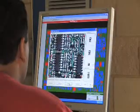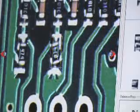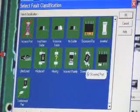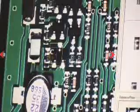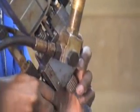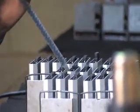The machine scans all parts on the board and then compares it with a known image as to what it should be like. It will detect any wrong parts, skewed parts. We can set the sensitivity of the machine, so we always set it oversensitive, so that even if the printing by the manufacturer on the part isn't exact, it will show it up as a fault. All faults are then visually checked and magnified by the operator to see whether it is indeed a fault or not. At this stage, all the Unichips are encased in an aluminium box, then filled with epoxy resin to protect it against vibration and moisture ingression to make it a tougher product.